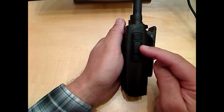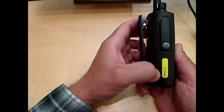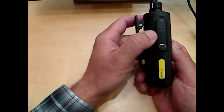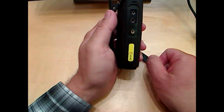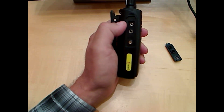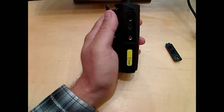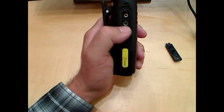There's the push to talk — hold it down, count to 2 in your head before you start talking. On the other side, there's a spot to write the owner's name, or if you're using DMR, the radio ID number. There's a speaker mic connector on the side, which is also where the programming cable connects. If you're used to Baofeng programming cables, do not insert the Baofeng cable into this radio — you will blow the chip. There is a special TYT programming cable required for this model, the MD-680.